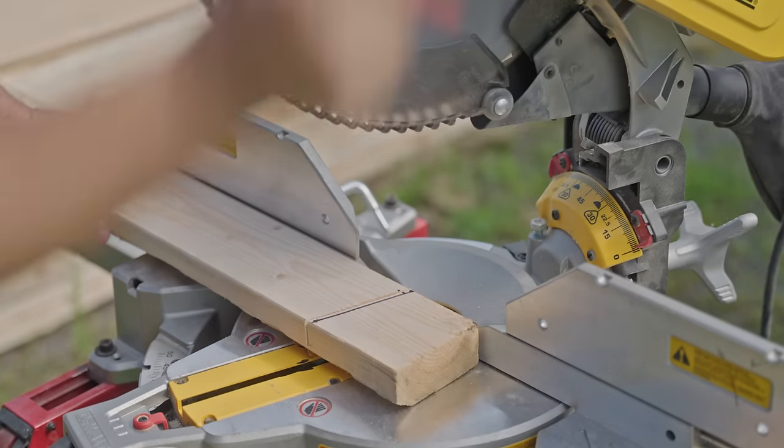What I was doing yesterday was putting three nails along the front side and then toenailing on either end. Jeff pointed out that this is not a structural portion of the structure, so that's useless and a waste of nails. But I'm going to do it anyway. Now you're in rhythm. That's how I was doing it. Yeah, I'm going to get roasted by all the framers, but that's okay. So I'm going to start by toenailing it because I want it to be flush with our top plates here. So I'm just going to toenail the thing.